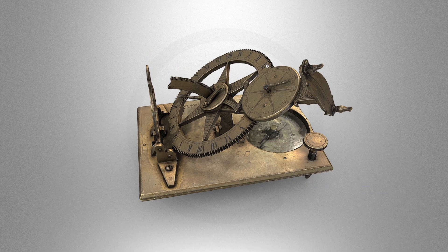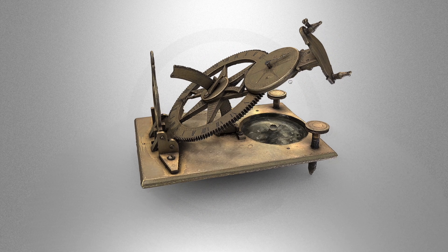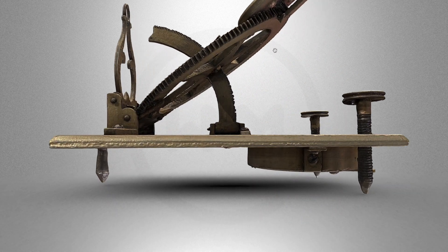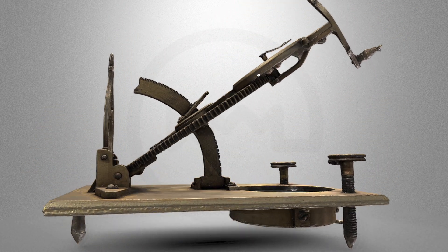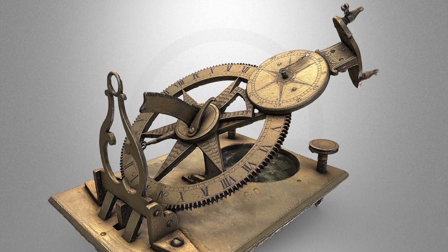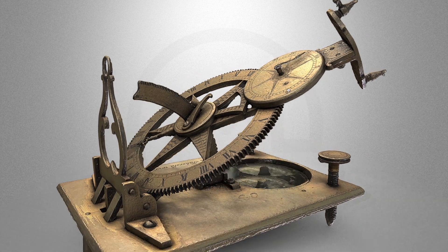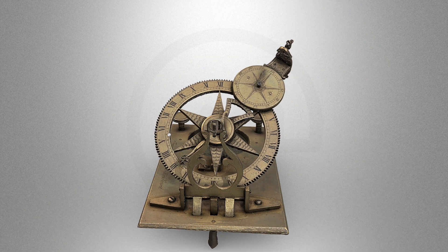As this arm rotates around the dial plane, the minute hand also rotates around its face. It's able to do this through the small gear connecting the hand to the gear around the edge of the equatorial ring. In fact, this is the only reason there are gears at all in this dial — simply for the movement of this minute hand. As the arm rotates around the equatorial dial, the minute hand rotates as well, swooping out a full rotation each time the hour advances.